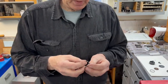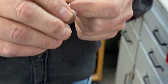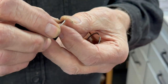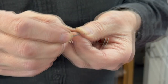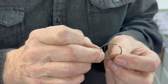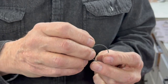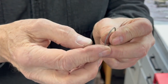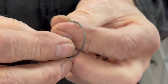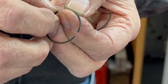I try to make most of my piston rings square — in other words, the thickness and the width are the same. The size doesn't mean anything; it's the fit. As long as it fits good in the groove in the piston and fits good in the cylinder, you're fine. The way you can tell if it's fitting in the cylinder is by looking at how it wears. If you take it out after running it a while and see a dark spot, it's not hitting there and it's not making good compression.